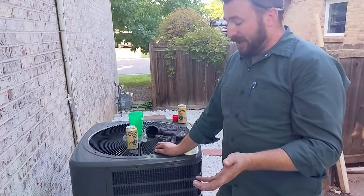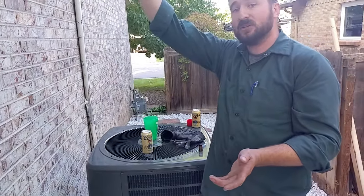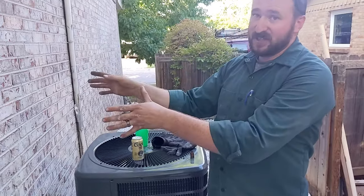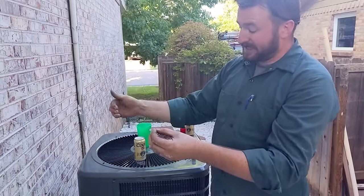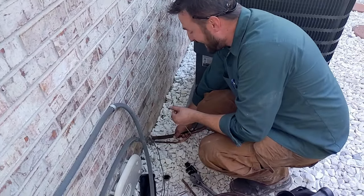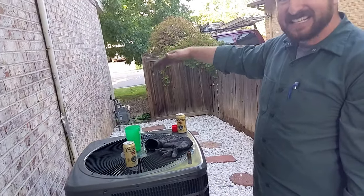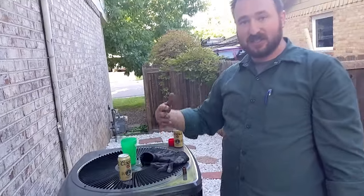Hot goes to cold. And then I'll take that liquid line and send it inside to the evap coil. You've got the indoor blower motor blowing the hot air from the house across it. Just like holding your hand down an aerosol can, it gets cold on the top. That's the transition from liquid to a vapor. The change of state makes it very cold. If that hot air comes across from inside, I pick up heat from inside, and then I take that heat on this cold, heated vapor line into the compressor, heat it back up to get the heat out of it, because I have to make it hotter than the outside air. We continually do that process, and this refrigerant is actually classed as a solvent.